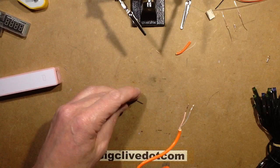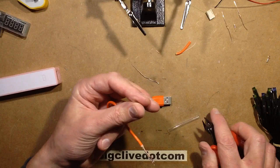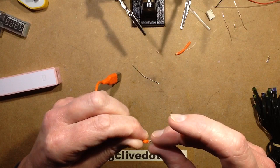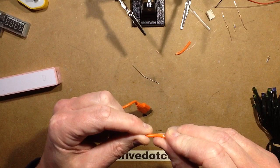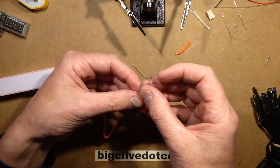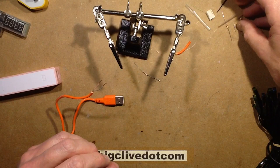I'm going to put red to red and black to black, and I should get 5 volts. If I had negative 5 volts the polarity would be wrong, but the polarity is right so that's fine. I'll unplug this before I inadvertently short it out. Now I'm going to tin those leads because I'm going to be soldering them onto resistors — just flow a bit of solder onto them. I'm also going to be putting a bit of sleeving over the base, so I'll cut about an inch or 25mm of the 3.2mm sleeving and feed it over all the cables including the data cables, sliding it out of the way so I don't accidentally heat it while soldering at this end.